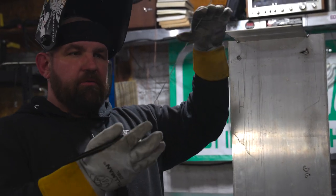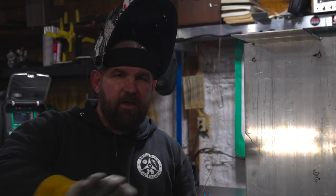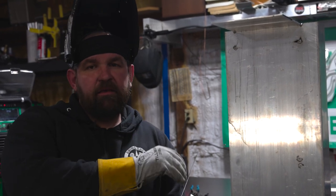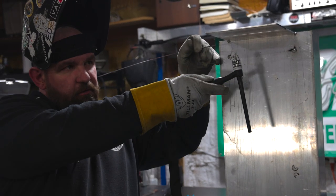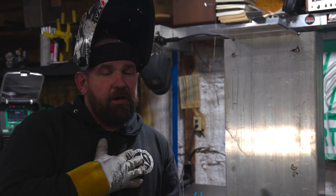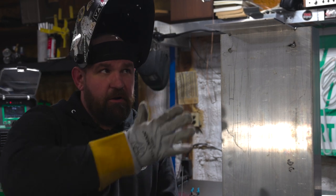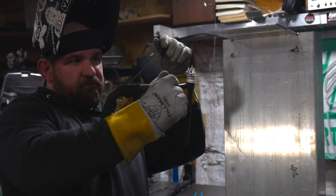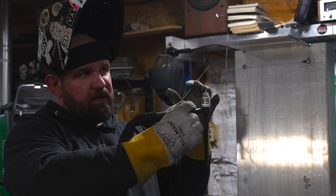Now in previous videos we showed you some techniques to bias your tungsten or your filler rod addition running vertical and horizontal. All that's out the window with overhead. The best way to think about overhead TIG is it's like running flat, but it's upside down. You're still watching your tungsten angle and your torch angle, and feeding your filler rod right down the center of the joint. It's not like running overhead MIG or overhead stick where your settings and technique vary quite a bit. For me personally, running overhead TIG is the easiest — second only to running flat. Vertical and horizontal are harder for me than running overhead. The main thing is just making sure you're in a position where you're comfortable, you can feed your filler rod, and have a good view of your puddle. Other than that, it's like running flat.